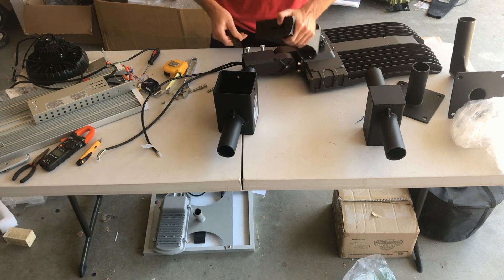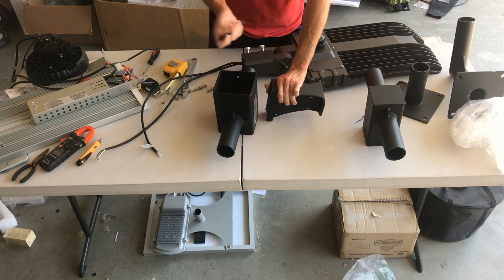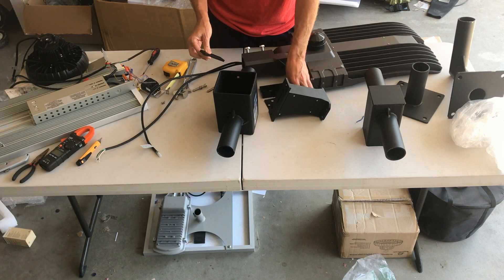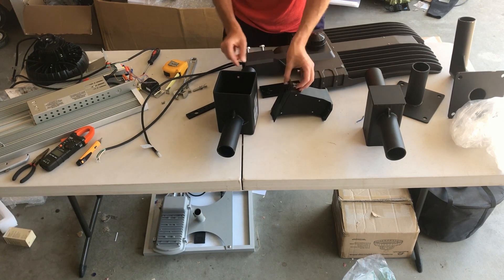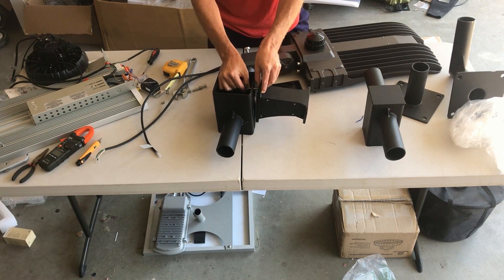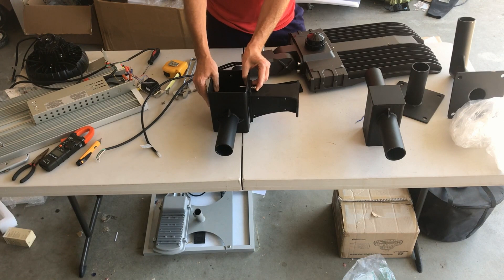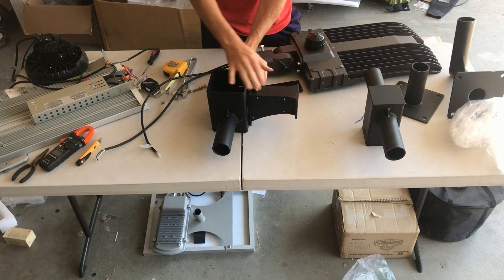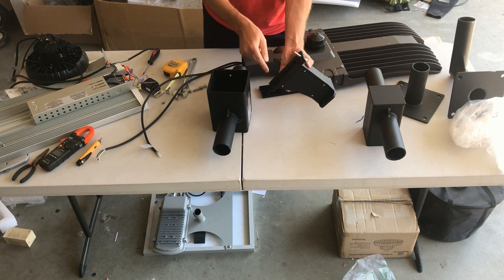This piece slides inside your pole — I don't have a pole here so I'm using a demo. In this case we're not going to use the round plate adapter; we have a flat plate, so we'd use the flat plate adapter. You still want to use the gasket, which allows you to connect the light to it. You're basically sliding this inside and then connecting it. The direct mount has the most finished look, which a lot of people prefer, and it's easy to direct mount to a pole. If you don't have a bolt mount, you can easily drill a bolt through to connect it as needed.